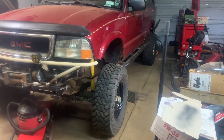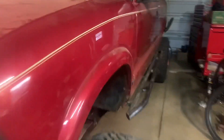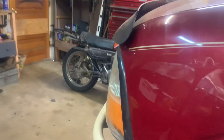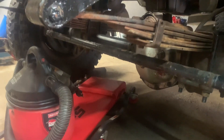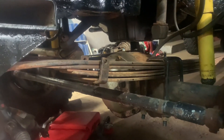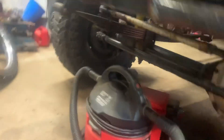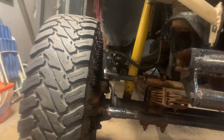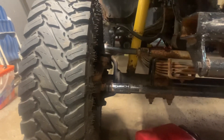Since the first drive I had to do a few things. First thing I did was it didn't have shocks on it, so I had to finish this shock tower. Second thing I did is I added a spring in — second or third from the bottom spring — and it actually lifted it an inch adding that spring in there. I also added some fuel line on my brake hoses just to prevent them from chafing.